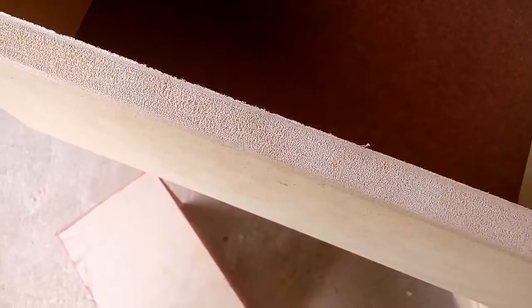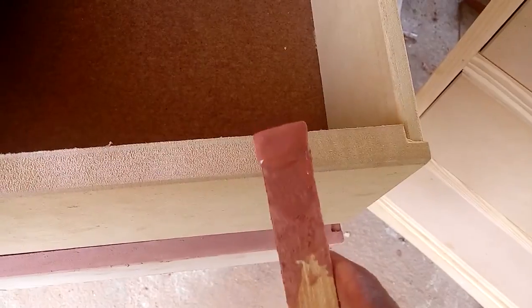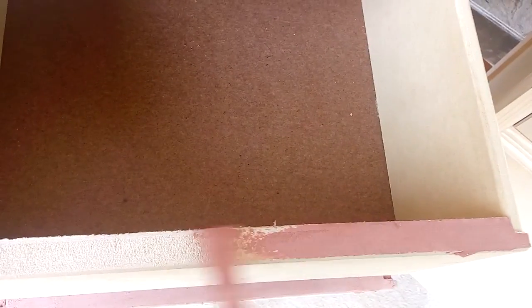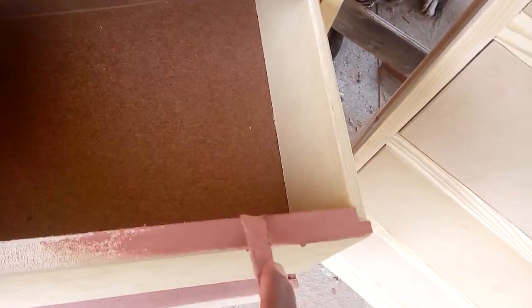This one doesn't have it on there, and this one I've already applied it to. I'll show you a piece I was practicing with — here is a finished piece that I did. I just applied it with a stick. My concern was that because it's a water-based filler it might ruin the MDF, but as you can see it didn't. At that consistency, what it does is fill all the pores.